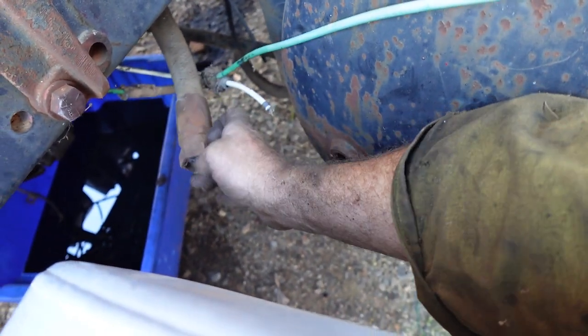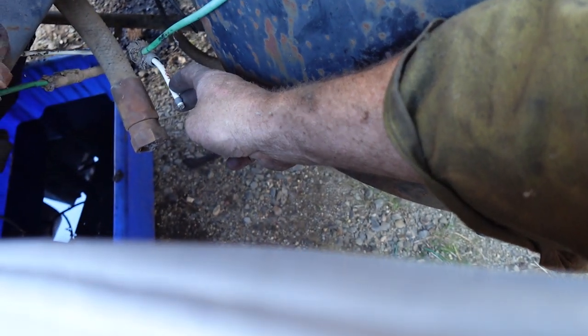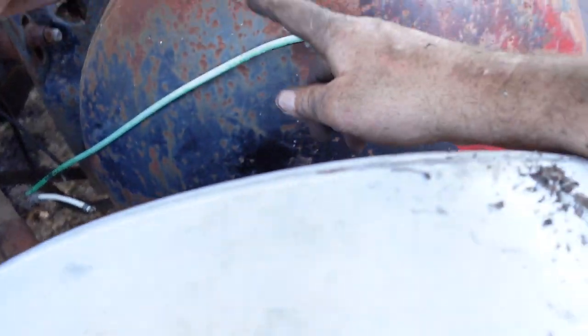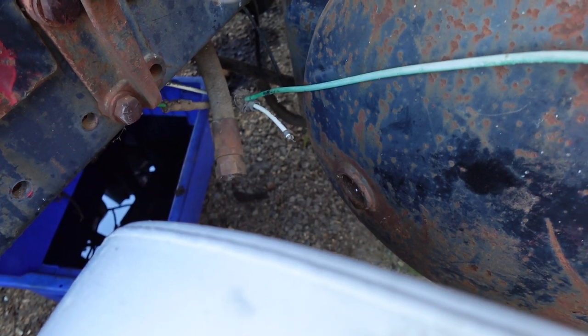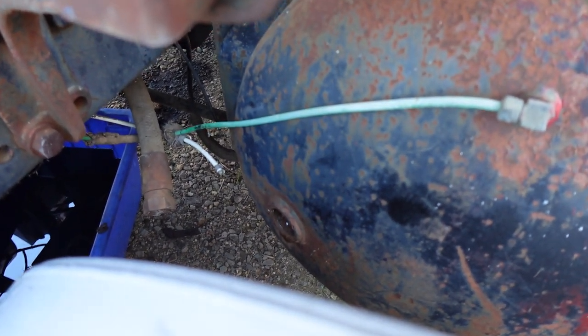Obviously that's an existing air start hose. That white hose there goes in the top of your piston, which is on the small end of that Sealco fitting, or Sealco valve I should say. The green line here goes out to your solenoid in your truck. Anyway, I'll get that together and then we're going to be pretty close.